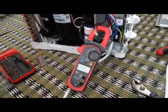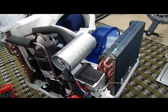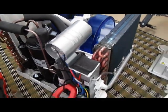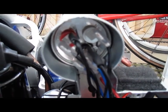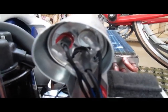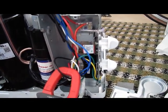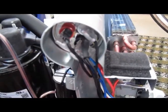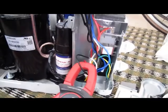I took off that additional shroud just so that I could get this out of the way. I'm going to go ahead and wire up the capacitor. I've got to find some shrink wrap or heat shrink tubing — and we're back. I think I got this all wired in properly. The one that's kind of all by itself is for the fan. Then the hard start cap is wired right in with — I guess that would be maybe the run capacitor. I'm not exactly sure; it's not just like my central AC unit. But I think that's all proper. I went ahead and put some shrink wrap on there. I'm going to put a little bit of insulation on there just because these are a touch longer than the 90-degree pigtails.